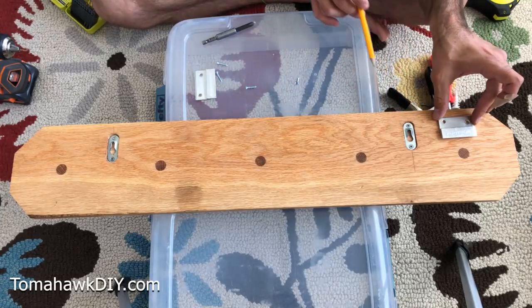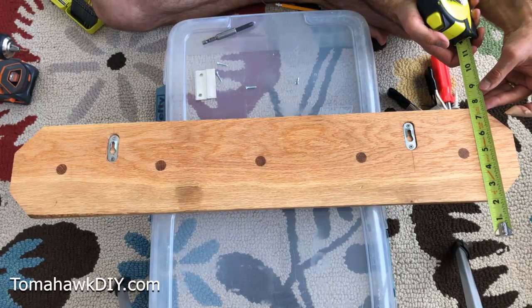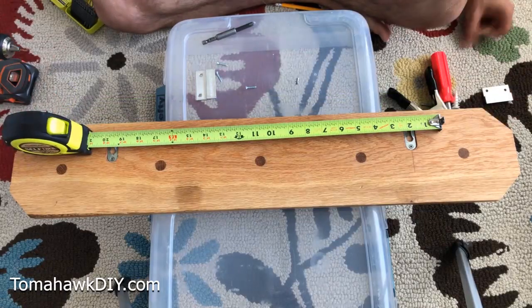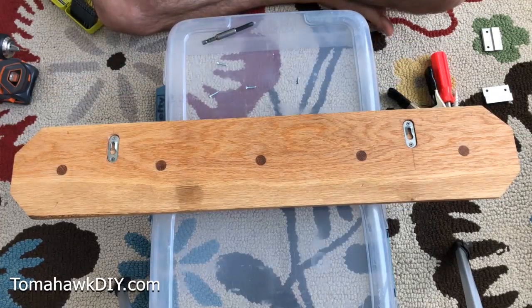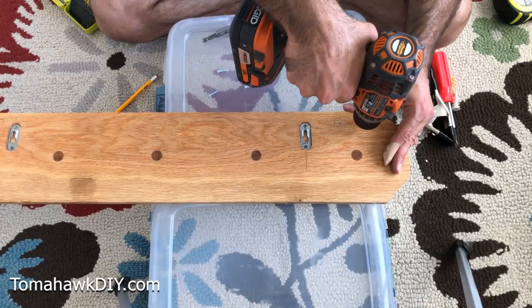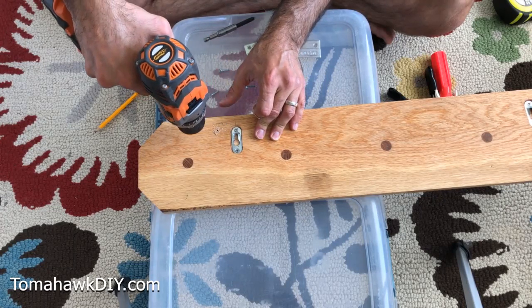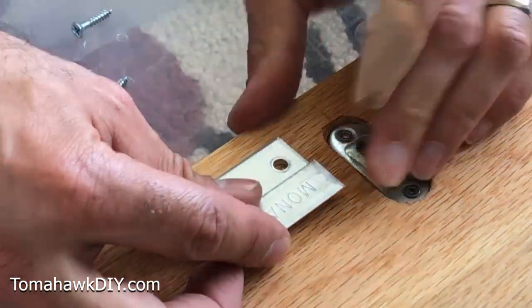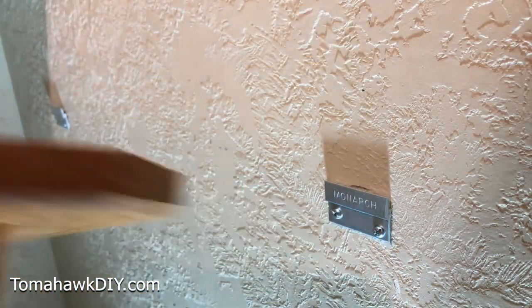Let's get these anchors put in. Now we're ready to get our clips put in place. We'll line these up about the same here. We're just shy of a half inch on both sides. The other clip, based on my measurements, is 22 and a half inches from edge to edge. Ready for drilling — I've checked the depth of my drill bit to be sure I'm not going to go all the way through; that would be bad. Let's line it up and get clip number two in. With our Z-clips on the back, we're ready to hang this on the wall.